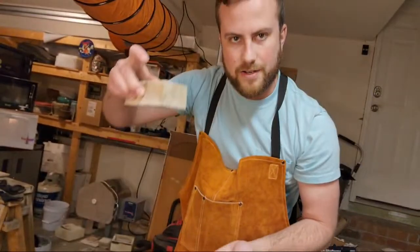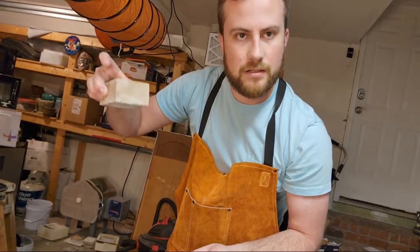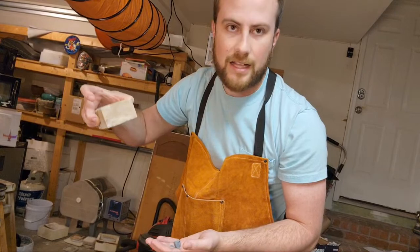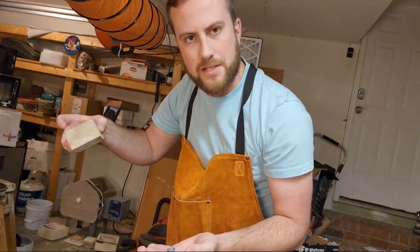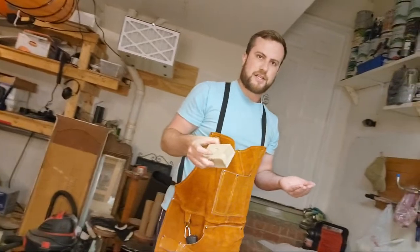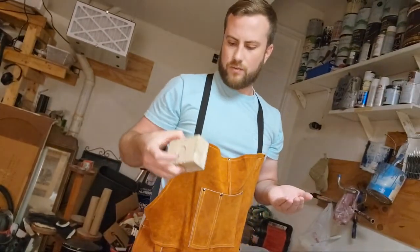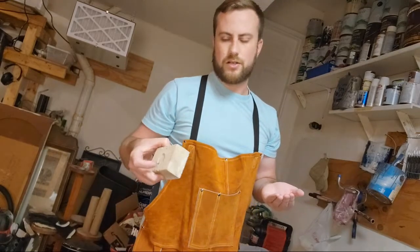And the last component would be our trusty microwave heating element. This is an alumina encased silicon carbide heating element that is kind of calibrated to the temperatures that we're trying to achieve for aluminum sintering, which with our tests seem to be closer to around the 1600 degrees Fahrenheit mark. So this is about the max that this element can reach.